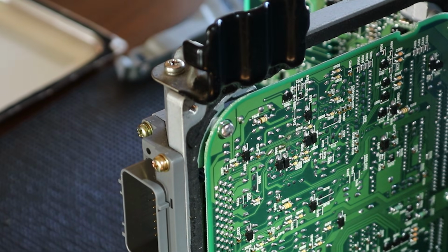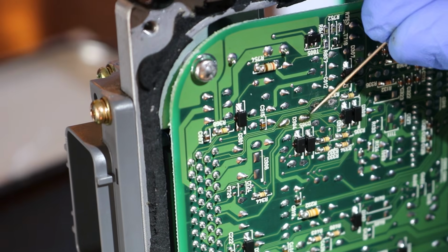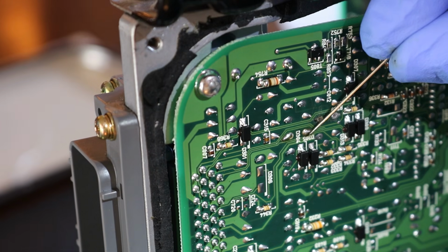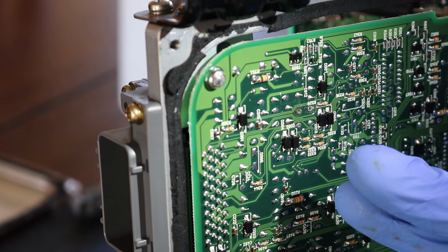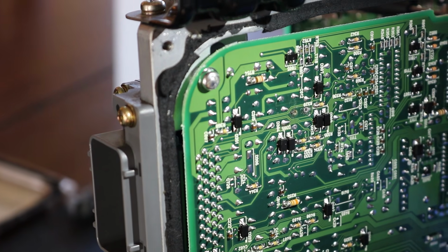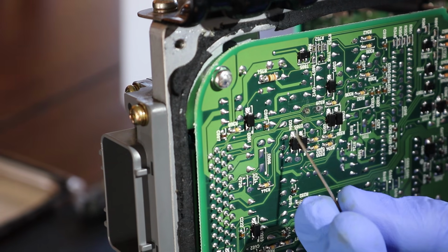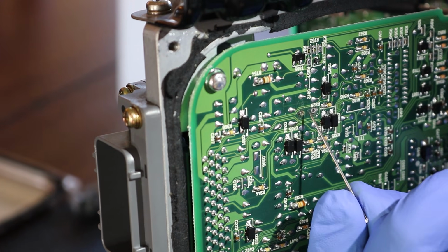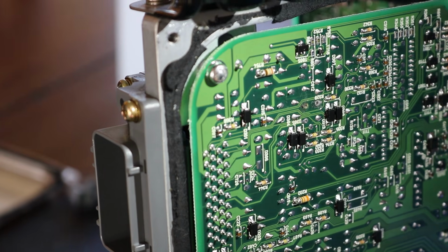You know what? That one took it, and I've learned something in life: you just leave it alone. So those are our solders. That looks fantastic, guys. The last thing I did was clean up, using some alcohol around the board to clean up some of that flux and pick up any of that cotton from the Q-tips. Overall, I am happy with our solder and our capacitor install. I'm going to go get this little pad replaced and get that one finished up. But the main goal was to show you guys how to replace a capacitor, and we did it.